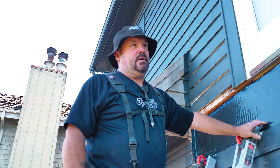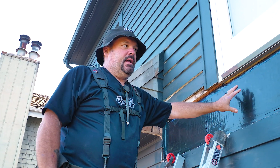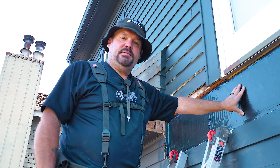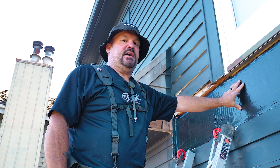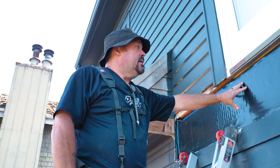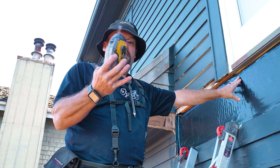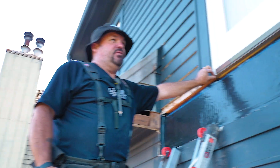So we have our house cleaned up and we put G-tape on the house. G-tape is a waterproof membrane tape to protect the side of the house in case any moisture ever gets back here, which hopefully it won't. Now I've chalked the line with my chalk line and I've put it an inch and an eighth below the level of the door. Now this door has a slight crown in it.